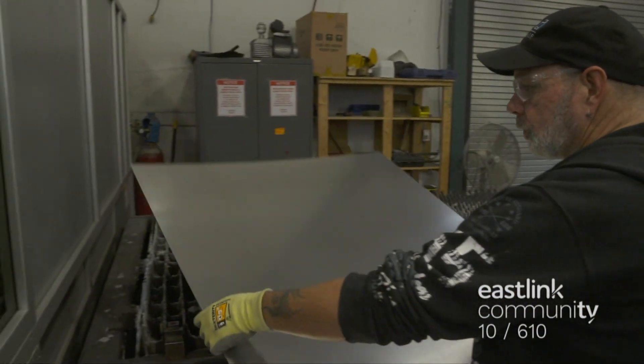A die is installed on the press brake to create the specific fold needed. The enclosure part is then placed under the bending tool and bent to specification. The bends are checked for accuracy against the build sheet and then signed off. The press brake is used to achieve certain bends that the Folder Machine cannot. The Folder Machine also bends the metal enclosure pieces, but it's faster than the press brake and can perform more complex bends. It's a helpful machine in creating multiple quantities of the same part.